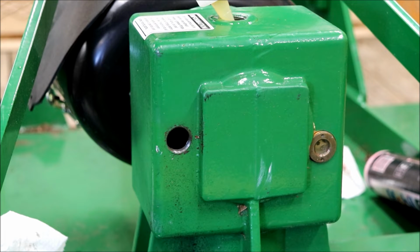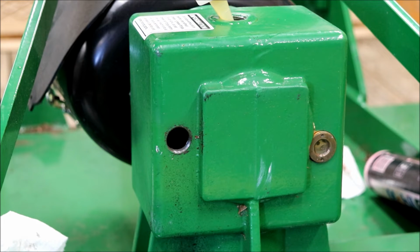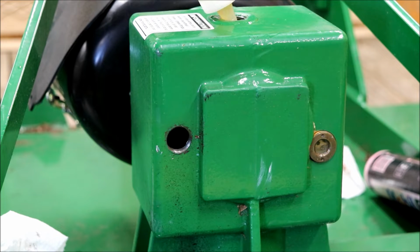water. I'm also going to put a tarp or a cover on this when I have it out at the woods. I don't have a structure to park it in. I don't have enough space in the shipping container to put this and the tractor, so I'm going to put a cover over this gearbox, or maybe even the whole thing, just to hopefully prevent water from getting in there. The other thing I should mention, I have this on the trailer. I actually had to lower the trailer in the front to get this somewhat level. Otherwise all the oil would be towards the back of the gearbox.